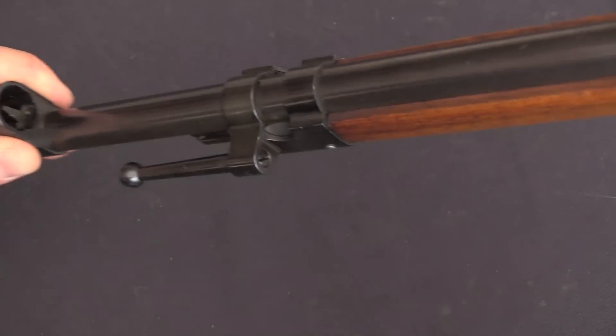The more fundamental problem is that this rifle is loaded with really fancy little features that were both too fragile and too expensive to put into the full production gun, which they wanted to buy like 100,000 examples of. So what we'll see with the 35M is the same basic system — a Mannlicher Schönauer turn bolt action, the M95 pattern magazine and clip — but dramatically simplified. The folding buttplate: gone. The really fancy oiler bottle and integrated cleaning rod holder in the buttstock: gone. The dust cover: gone. The fancy shaping of the front of the magazine and other detailed elements were all significantly simplified to reduce the cost of what would be the 35M.